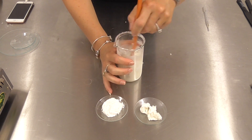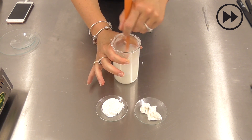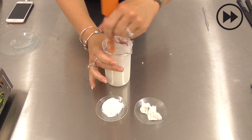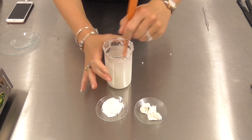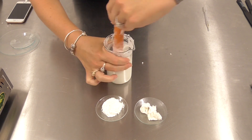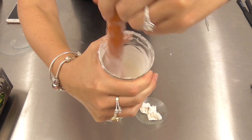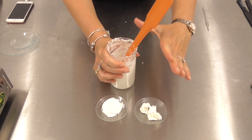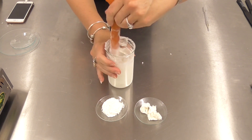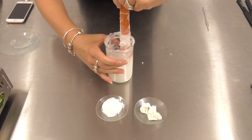As you can see, this is again why sweeper blades are a very important manufacturing requirement. With the wax product you can't let it cool to the point where it sets — you need to pour it off, but stirring is still very important until you start to see the product trace. You can see the trace of the sweeper blades — when you start to see that with the wax, you know you've got good mixing. Continue your mixing and hold that temperature for at least 10 minutes depending on batch size before you start pouring off, and that way you'll have good product stability.